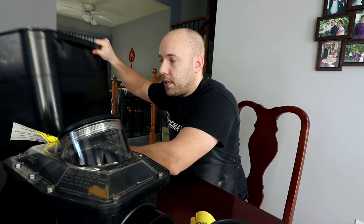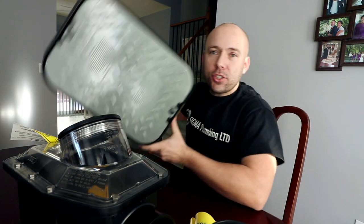And then this right here is actually the box that you put on top of the backwater valve in order to make sure that you can now cement everything and the backwater valve will be intact. And when you need to service it, you could actually just unscrew these guys right here, access the valve, and then you can put the lid back. It should be flush with the cement by the end of the installation.